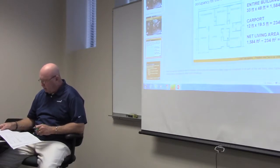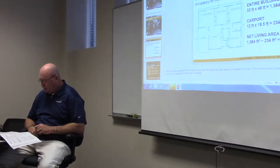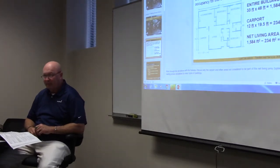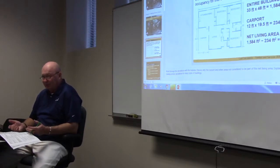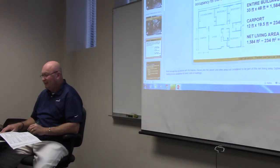Number 11, the neutral load for a hot water heater is blank in a dwelling. Anybody ever hooked up a hot water heater? It's unused. Yeah, it's zero or unused, right? Because there's no neutral, right? There is no neutral. So you put it unused or zero. Okay? Trick question.